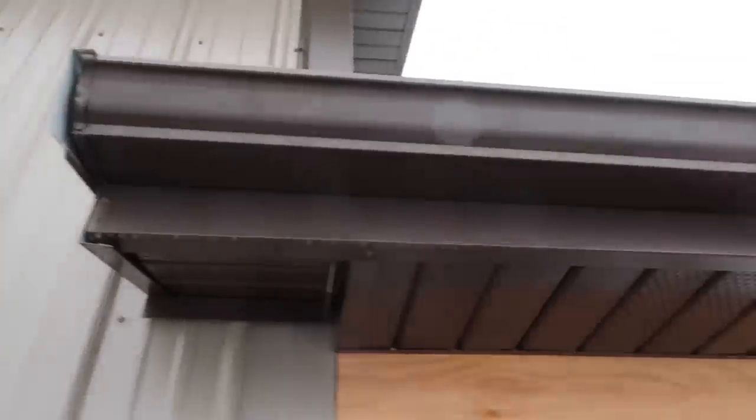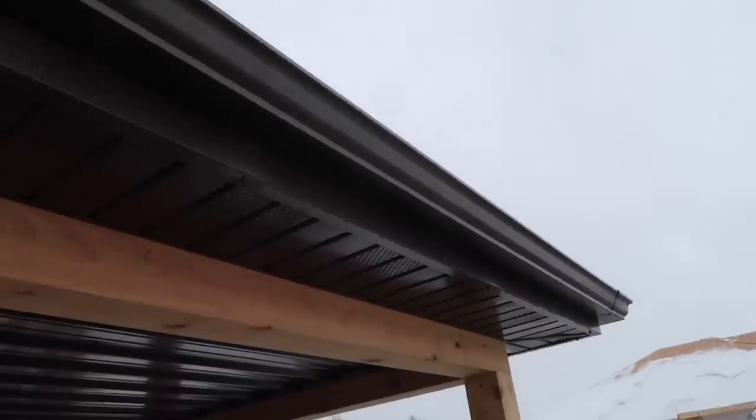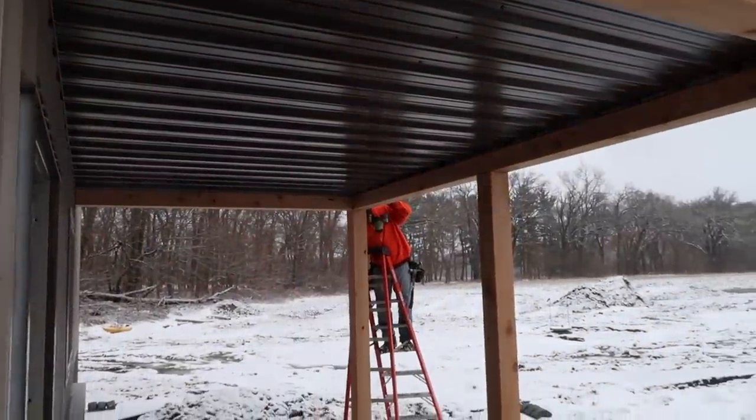These guys do good clean gutter work. So it just is another little added detail. We got the gutter wrapping around and it's gonna empty out over there so you don't see the downspout. And then up here on the upper section, we'll just have one downspout. And my rule of thumb is always minimal downspouts. I have no problem a customer needing more downspouts later, but on a building this size, usually one downspout is gonna take care of it.